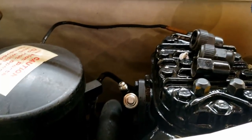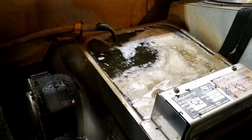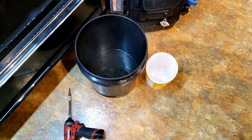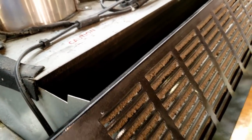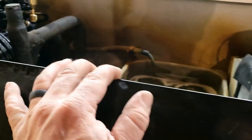Checking head pressure too — oh boy, it just kicked on, dumping more water in there. That is not good. I got a big bucket to collect some of that water because it's starting to overflow. Head pressure is a little high. I've got the filter media out checking things, making sure that's clean. Brushed it out — doesn't look too bad. You can see that heater is kicking butt, boiling that water out. Suction doesn't look too bad either.